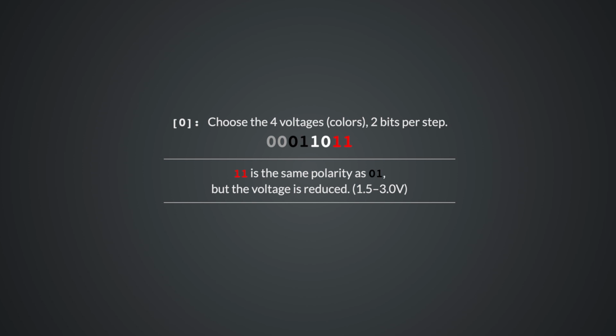working with custom waveforms on these was the single most headache-inducing nightmare of the past 2 years working with EPDs, because it is such a weird thing to try to model in your head. If you want a red pixel, you have to execute waveforms that prepare, jockey around the positions of all the other particles so that when you finally apply voltage 1,1 there, the red particles race the black particles, and the red ones have to hit the glass first, and it's really hard to do.